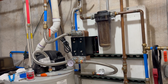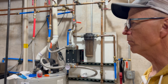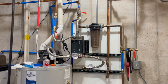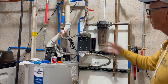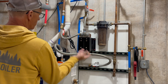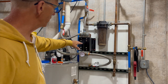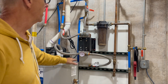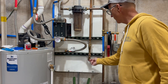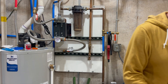I've done lots of copper — I can solder, as you can see in my other videos — but I wanted to show people that they can do this themselves. I never thought about using braided line before. Copper would look better, but the average person can do it this way. The way I have this set up, all this 30-plate is doing is preheating my hot water heater. My return will come underneath my feed and I'll put an elbow and then a PEX fitting on that.